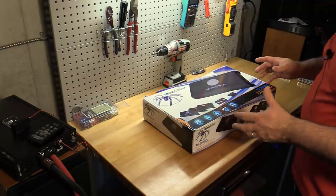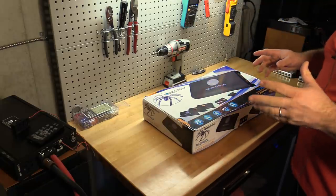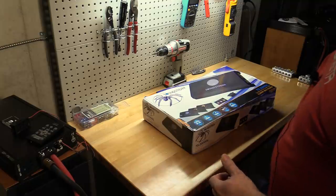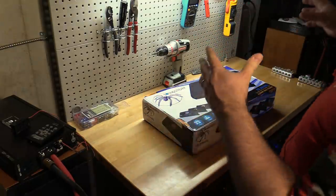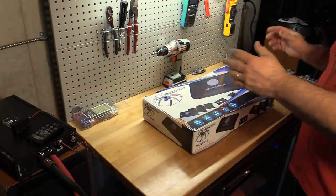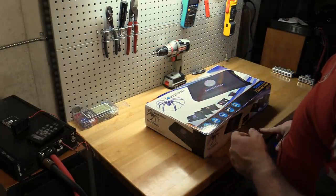Because if this holds true, this would be one of the stronger 5-channels that you can find on the market. Most 5-channels only say they're 2-ohm stable on the sub-channel. This one is rated to go down to 1-ohm. And it provides a decent amount of power for both the high channels and the sub-channel according to the ratings. But this is why we test these amps, because we're going to strap this up to the amp dyno. We're going to find out if what's on the box is legit for when you buy one of these.